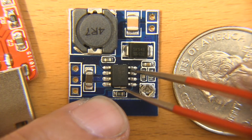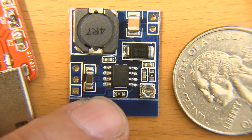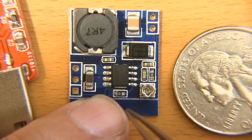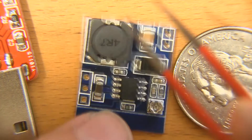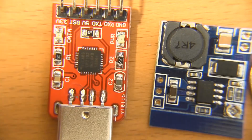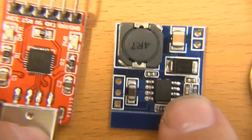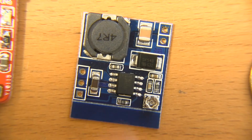As far as switching noise, the datasheet says the switching frequency is 1.2 megahertz, so I don't see this spewing any spurious RF noise in any of the control bands we work with — but I'll be sure to do an RF scan and post the results. These are two components that are going to go into the build I'm working on right now. The CP2102 is one of the tools I'll use to flash the open LRS receivers and transmitters, and the regulator is what I'm going to use to power the entire video system with this tiny little regulator.